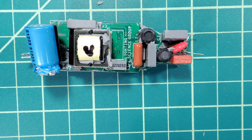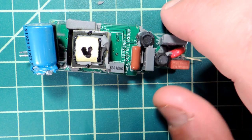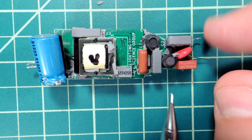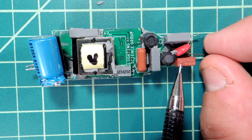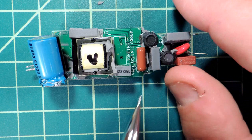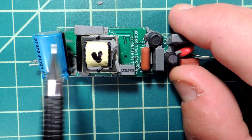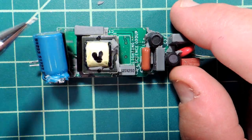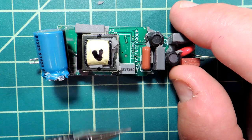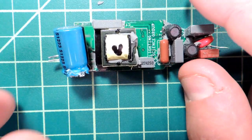Here's the AC-to-DC converter circuit. All LED bulbs need this — electric systems around the world run at hundreds of volts AC, and LEDs only need a couple of volts DC to work correctly. So all of these bulbs will have this kind of circuit board in them, though what varies is the implementation details. Coming from this side, this item is a fuse for safety reasons. These two black cylinders are inductors, and there are some capacitors here as well — these form an EMI filter, preventing energy generated by the circuits from being pushed back into the electric line and causing interference.